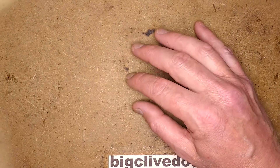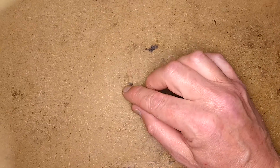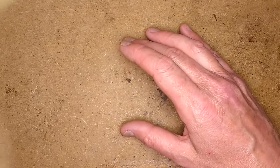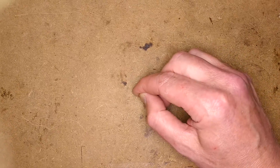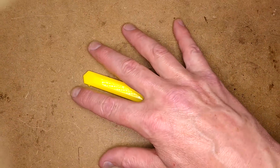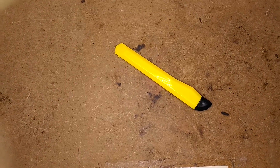It's nice that you can drill a hole through the middle, but note — don't go drilling holes through whatever panels you get, because that's not the same for all panels. With this one you can drill dead centre, but it's not guaranteed with others. The narrower panel I had before certainly wouldn't have tolerated it. It's interesting that it provides all-round illumination, but unfortunately it produces a hot spot on top and the heat will also warm your camera up. An interesting panel — perhaps not the best, but interesting nonetheless.